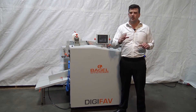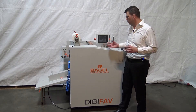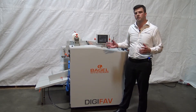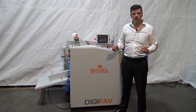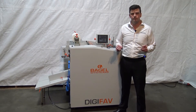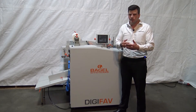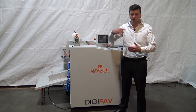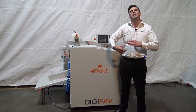You can watch competing machines — the heaters are kicking on continually trying to maintain temperature. This system warms up in about 10 to 15 minutes, a bit longer than electric systems. However, it runs on very little energy and maintains that temperature flawlessly throughout the run. It's also very efficient in making sure the outside of the metal roller is the same temperature as the inside, since the oil is in constant contact. The oil stays in the same position as the roller turns.